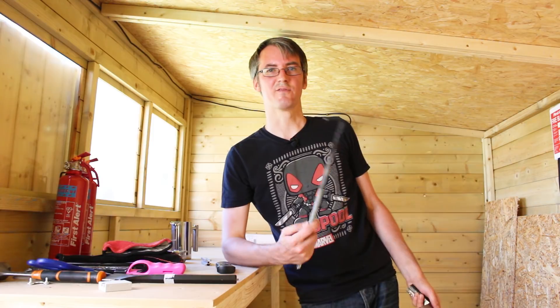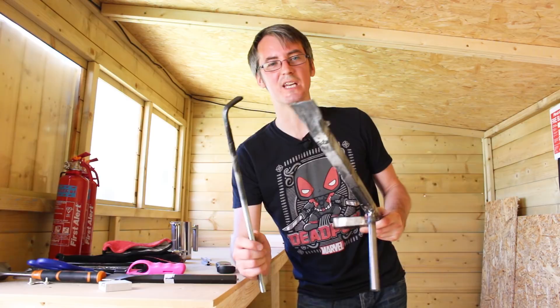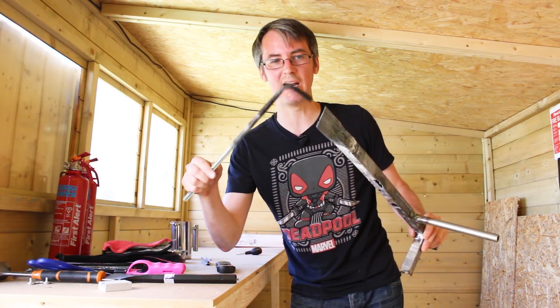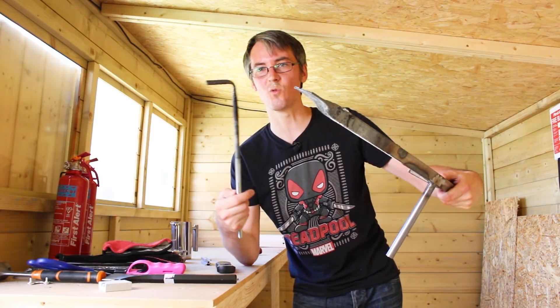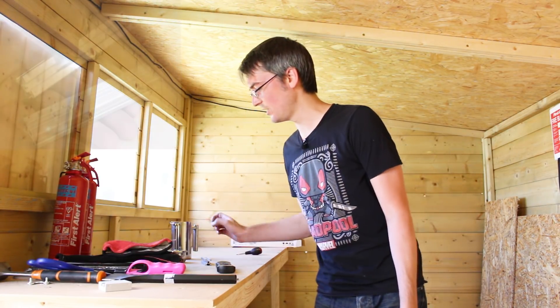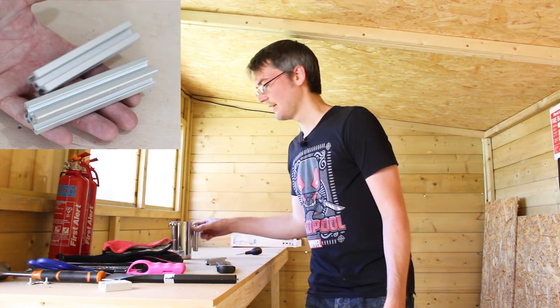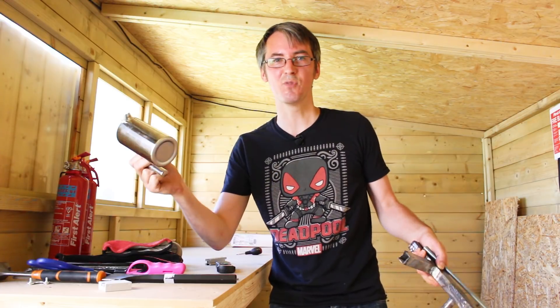Well, that was semi-successful, I guess. I managed to make this hook. The bar material holds its heat a lot more than the tube did. I guess the tube's got more surface area all around and inside to radiate heat, although it was a lot softer than it would have been for squashing it. So that could be quite useful. But can I melt aluminium extrusion in a stainless steel cafetiere? It'd be quite good to recycle all those bits and then machine them down.